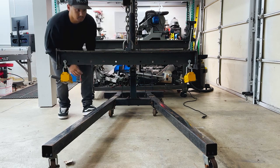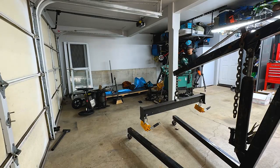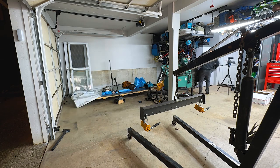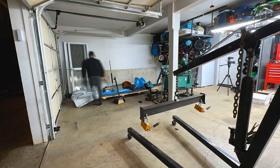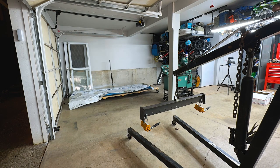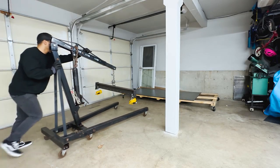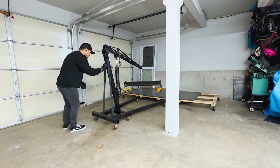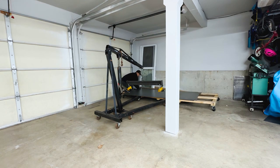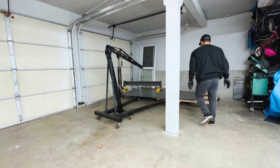I had some four-by-eight sheets stored on the side because I couldn't lift them, but now that I have this lifting beam it's going to help a lot. I'm just clearing everything out — this is hot-rolled pickled-and-oiled sheet, which is basically hot-rolled with no mill scale. I prefer this sheet when cutting on the plasma table because it provides a cleaner cut compared to regular hot-rolled with mill scale.